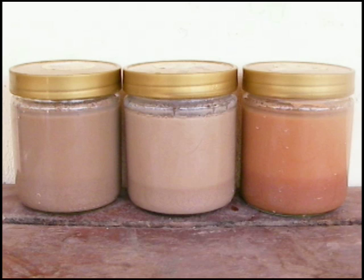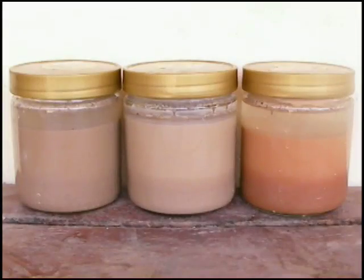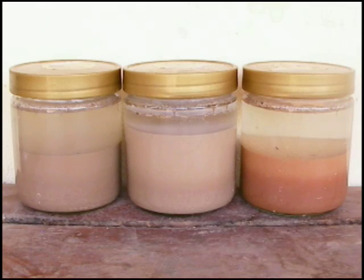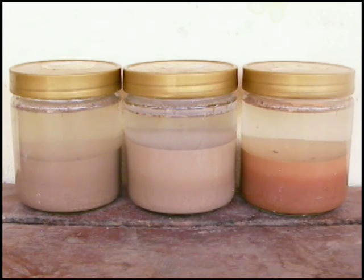After 30 seconds, here's sped up to 10 minutes. The fines — the silt and the clay — begin to settle. At 10 minutes you can see that the silt and clay has settled faster in the middle than in the ones on the right and left. And going up to 30 minutes, it's much slower in the middle one, meaning there's higher clay content than silt, as clay settles the slowest.